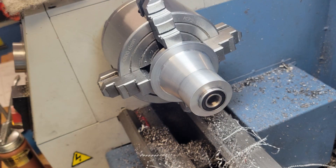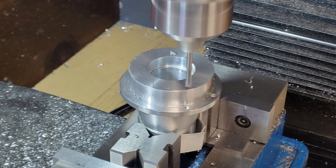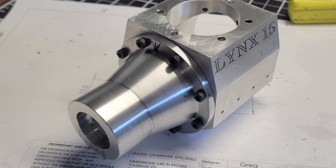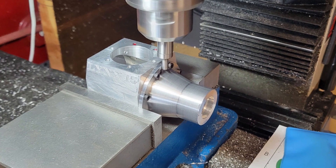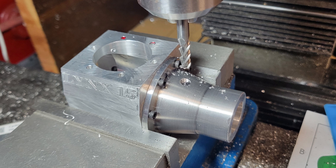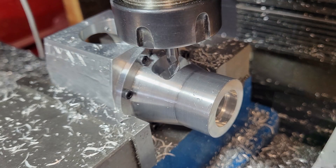Awesome! Let's now pull the part out of the lathe and mount it in the mill using our bolt hole center function to create the eight holes used to mount it to the main crankcase. Our final feature is the hole in the top of the crankcase for the timing belt. This needs to be vertical with respect to the main crankcase, so we mount the front crankcase to the main crankcase and then put it back in the mill. Here I'm centering my mill y-axis on the vise jaws, then I use the face of the front crankcase flange to zero my x-axis. I use a quarter inch end mill to rough in the hole, making one last climbing mill pass around the perimeter.